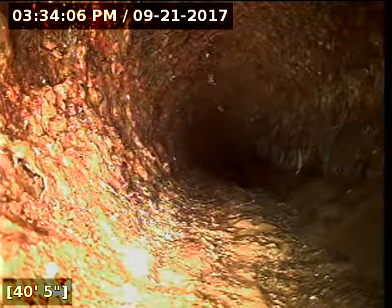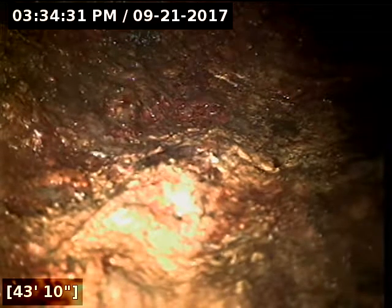It's really difficult to tell if it's riding up underneath the wall that is essentially the back where the mirror is hanging. That pipe is running side to side underneath the vanity down there. So it's difficult to tell whether it's going under the wall there or just inside the wall on the bathroom side. It's just a difficult spot to locate because it goes under the vanity where I can't really get the locating wand in. So I'll try and locate right here. I do have blue painter's tape that's going the direction with the line where it runs. And I have that marked just before where that belly or that worn out portion of the line is at.